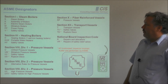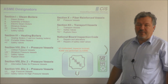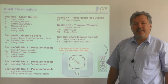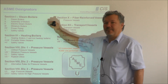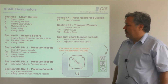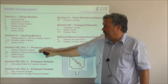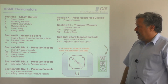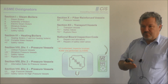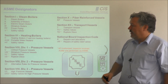Which designators are there and what are they good for? If you decide you want to be a manufacturer of steam boilers, then the S stamp — officially the ASME certification mark with S designator — is what you want. Heating boilers come with the H certificate. The best seller is the U certificate for unfired pressure vessel manufacturers. In all these cases, the manufacturer is the company which actually welds those vessels, boilers, and other pressure items and certifies them to be compliant with the code.